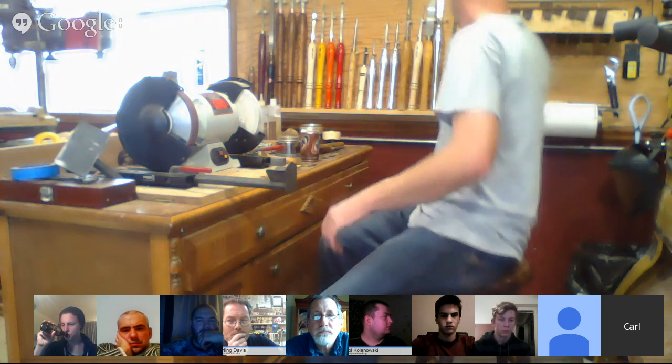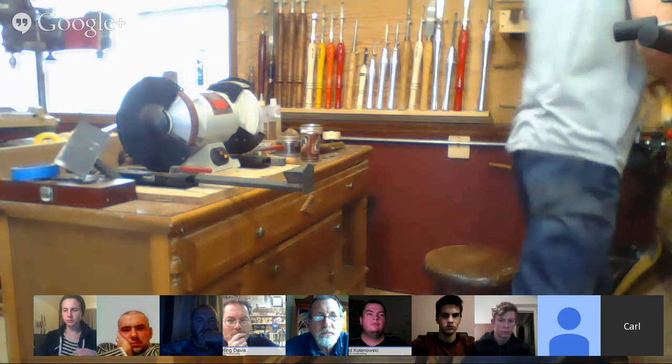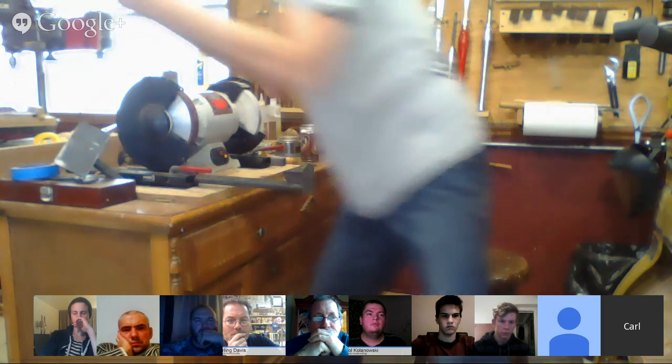So let's see. There it is. All right. So take a black Sharpie, color your grind there, and bring your tool up, lay it down on there, and then just hand turn the stone until you can see that the Sharpie's worn off all the way down. And then that way, you're not grinding away good steel. So you just keep moving this in and out until you find that spot, and then lock it down.